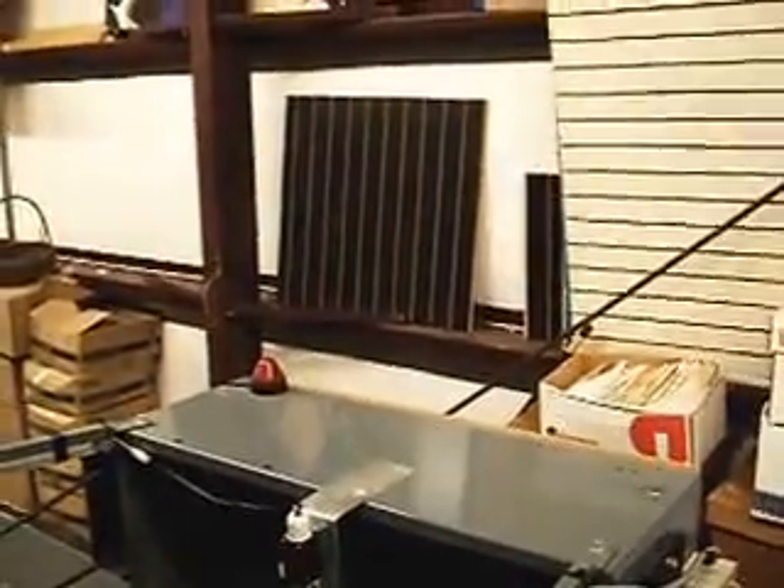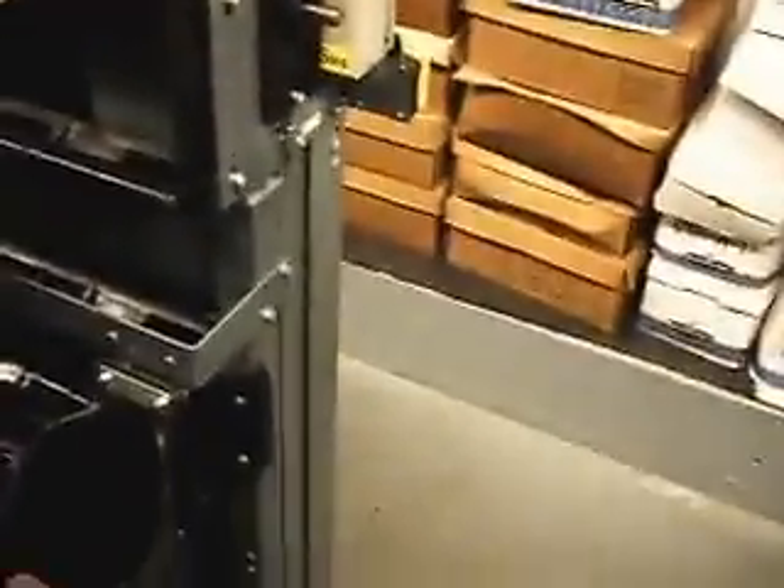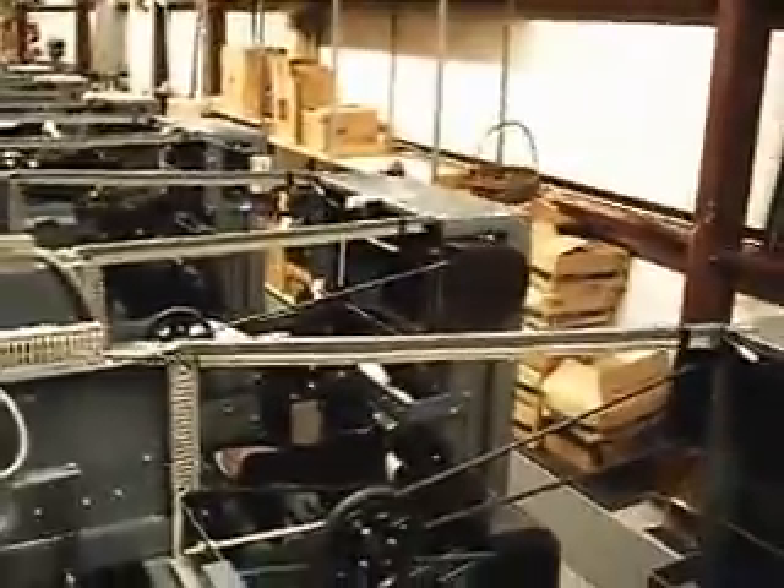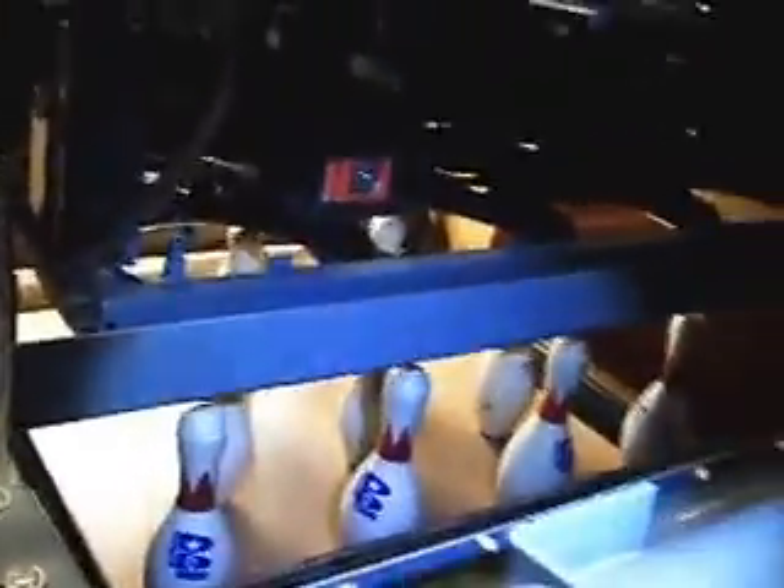I thought I'd bring you to the back and show you what was the culprit of all of this. Looks like some open bowlers didn't know when to let us know that there were some balls stuck — that stopped up the transport band and the ball accelerator, and that's what fried it. So let me clear it out and then I'll see if I can get it going. I got it all cleared out. You can see that it actually wasn't the ball accelerator motor — because the ball accelerator motor is working fine now that I put in the new high voltage PCB. Everything's setting up, pin setter's working again. Chose the right path. Hope this helps y'all out.